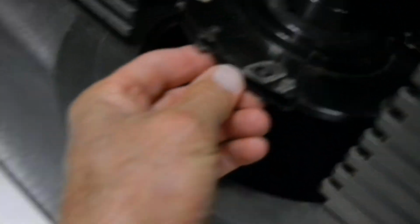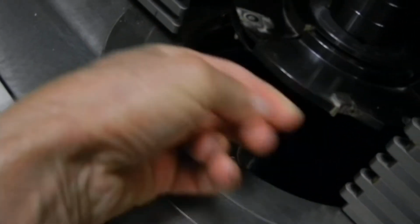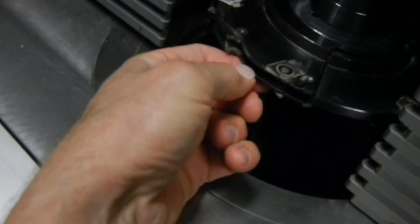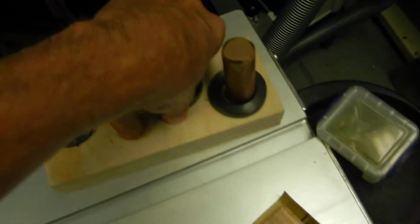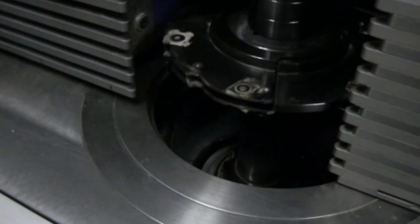This is walnut, which does a pretty good job of cutting. This particular cutter we have here is a 3-piece sandwich with a top, a middle cut, and a lower panel, or a lower piece of the tooling. So with that you can shim it, and I have some shims here of anywhere from 3/1000 up to as thick as you want. I have some of the spacers on the spindle, 30 millimeter, that are not being used currently because of the height that I want to get with the thickness and so on.